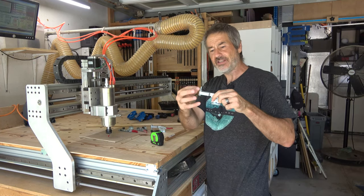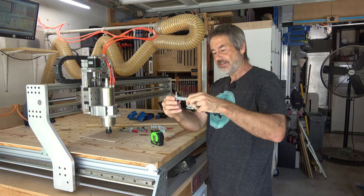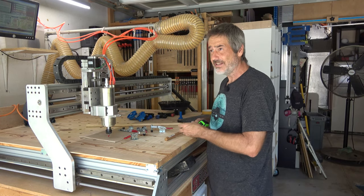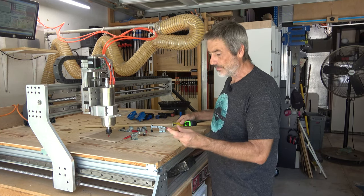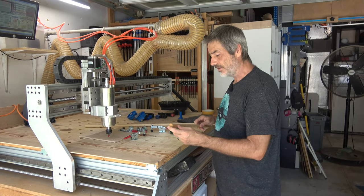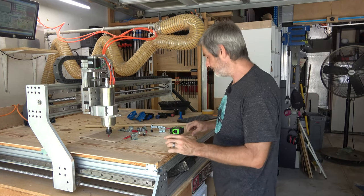This has some play, so I can adjust the screw to hold things down at different thicknesses. So I'm hoping maybe 1/2 inch will be good. So 1/2 inch for that, and 1 inch for the hole. So I'm going to cut these at 2 inches, and that should leave just a little bit sticking out through the bottom, but not too bad. So let's set up the bandsaw and just knock 4 of these out real quick.